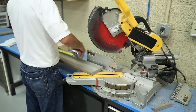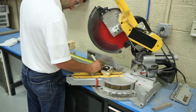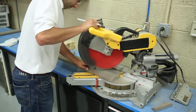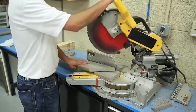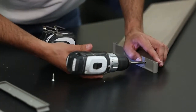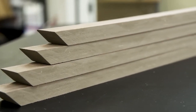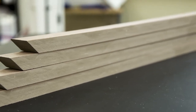Next step is to get ready to assemble the top frame. For this, you will need to cut 4 deck boards that are 31 inches long on the outside edge and have a 45-degree angled cut on the face. Turn these boards smooth side up and attach a horizontal top corner casting to the right side of each board. Then cut 4 deck boards to 29 inches long with a 45-degree angle on each corner. You will then rip these boards down to 2-inch widths.